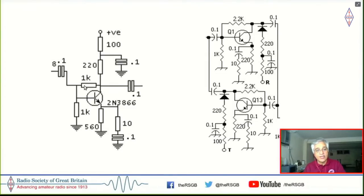So in order to avoid switching, I thought, what if we can make the radio go bidirectional? And I had seen a circuit of this in the SSB handbook published by the ARRL. So I thought that maybe if we build something like this, which is here on the right-hand side, it would work. And it did work. Again, I swept it with my signal generator and my RF probe. I think by then I had also got a friend to carry a very heavy Tektronix 465 oscilloscope, which really upped my game.